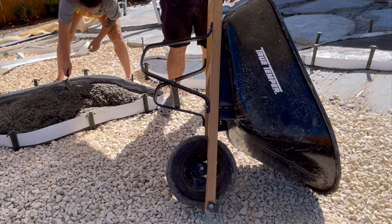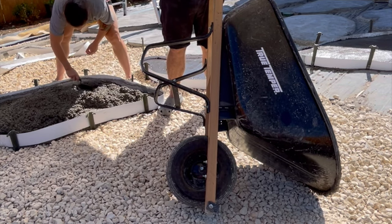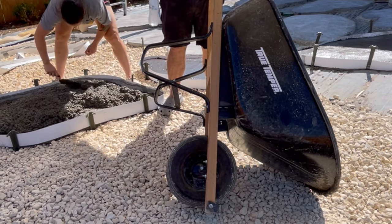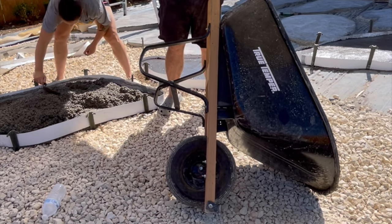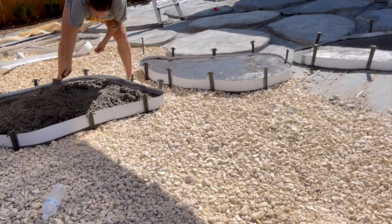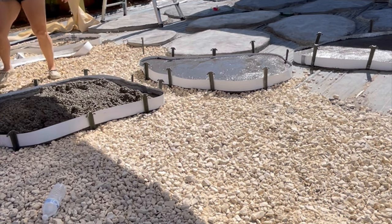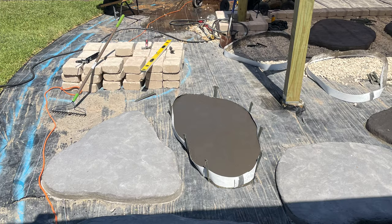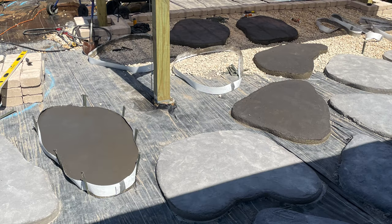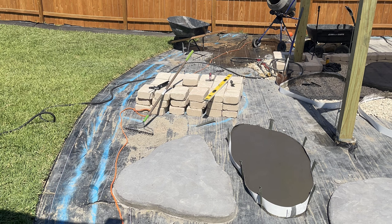How I did those concrete rocks — I found someone on YouTube that did them the same way. That mold is just a vertical vinyl blind, so I bought a pack from Lowe's for like $30 to lay out how I wanted all of them to look. Those are just some old tent stakes I used to give it its form, then left it in there for about 20-30 minutes because it was super hot out. I did water cure them — as they started to dry I gave them a mist of water from the hose on the mist setting.